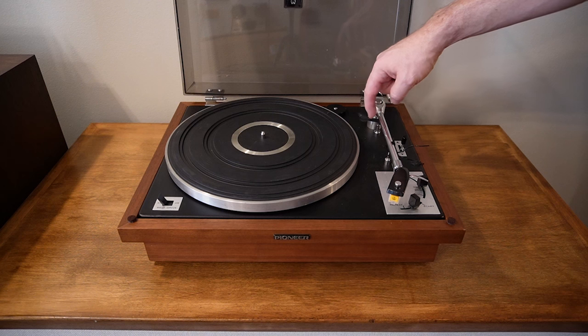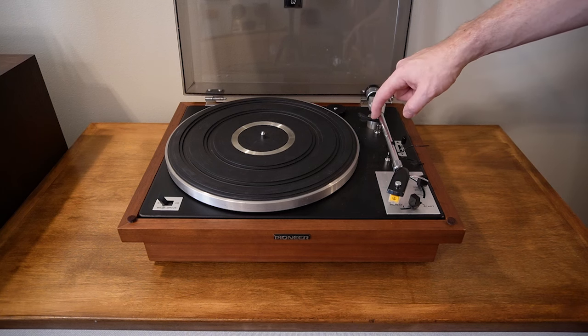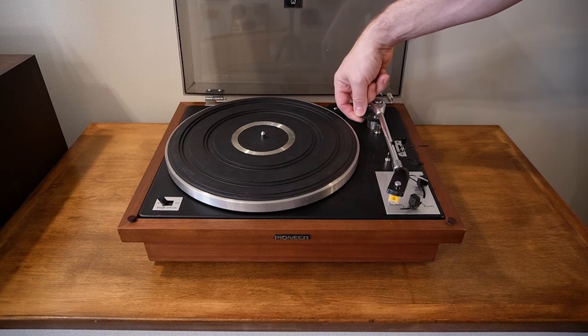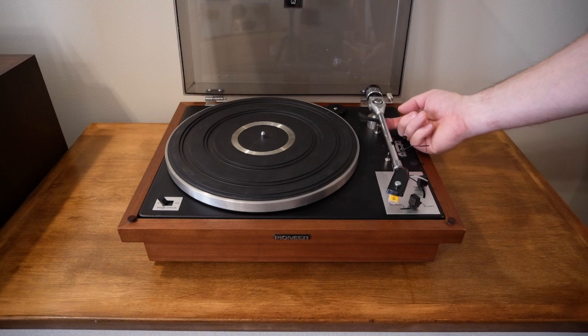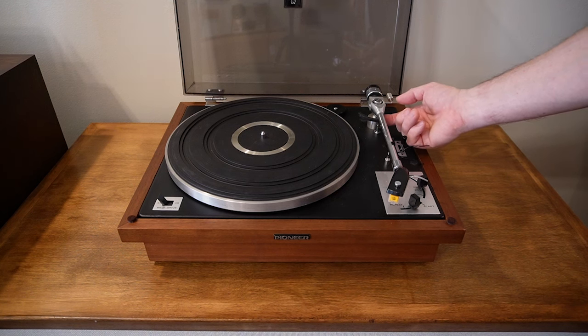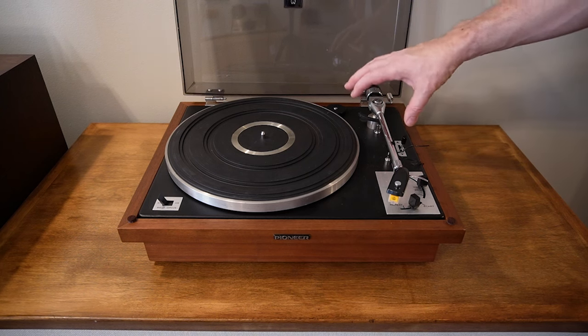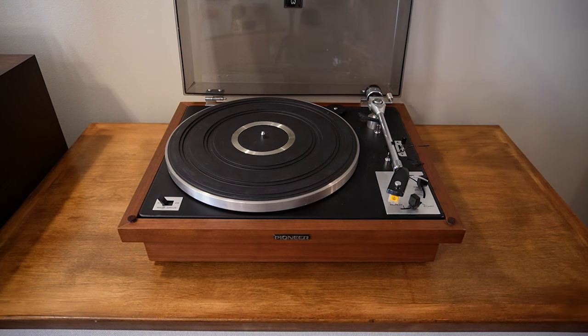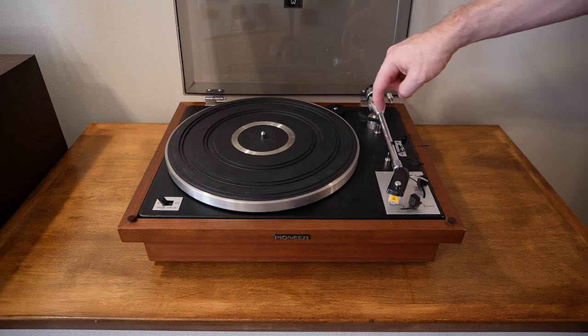The tone arm elevator guide, if this is broken or if it gets bent, you may have issues with it. This is also a piece of metal. Well, I think on this one it's a piece of metal. I know on the 41s it was. But on some of these it'll be rubber. It'll cover a piece of metal that's actually riveted to the base here. So if that rivet breaks, you'll have a guide that kind of flops around a little bit. It's not level. This one is actually designed a little bit differently. It has an arm that comes up and hooks, so this is a different design here. It may just be a single piece of wire.